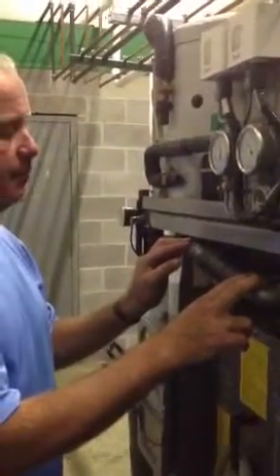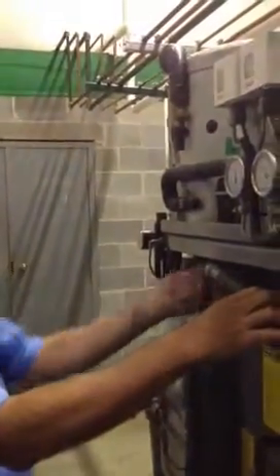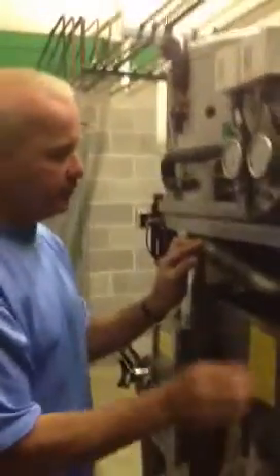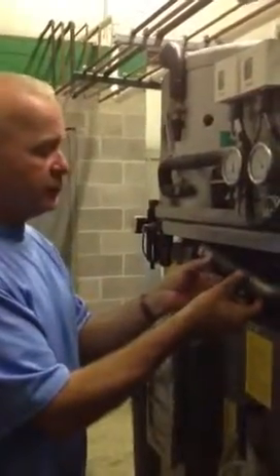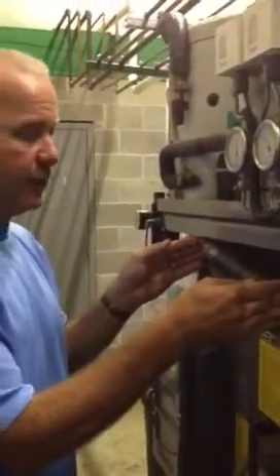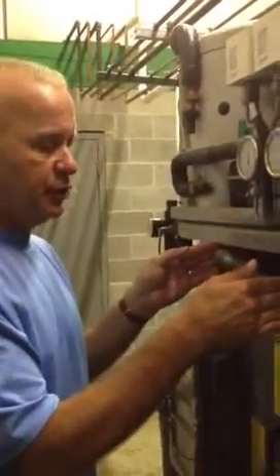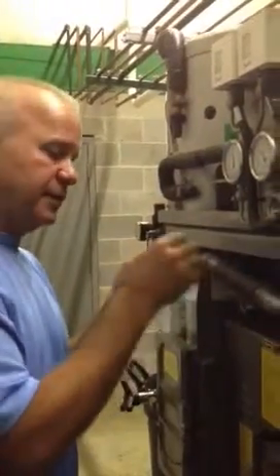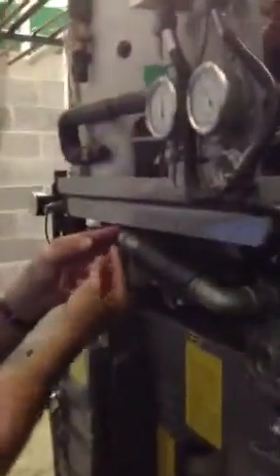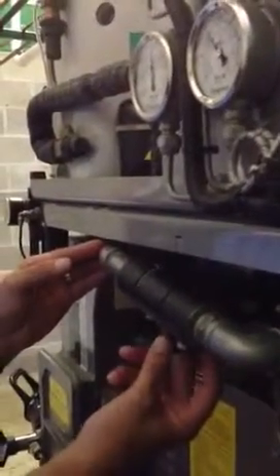Button number nine puts the power in this little unit here. The dry control sensor — as the solvent flows back from the drying recovery head and goes on to the separators, it's flowing along this pipe. What the dry control sensor does is, although the computer program may be set for 20, 25, or 30 minutes, however long it's set in the program, the dry control sensor is made to ensure that energy usage is optimized. If it's a smaller load or the garments are drying quicker, all it does is sense the amount of flow of solvent coming along based on heat.